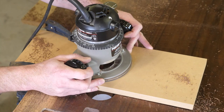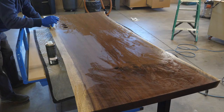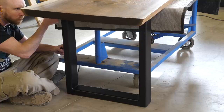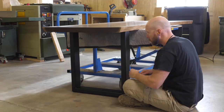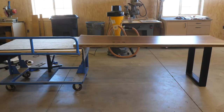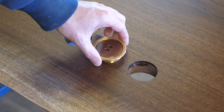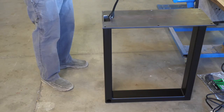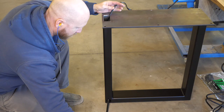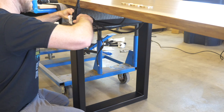Last detail is to bore out some space for the nuts that hold the grommets in place. I decided to add one final coat of finish — this is Rubio's maintenance oil. After buffing off the maintenance oil, it was time for final assembly. I had to come up with a way to hold the table so that I could fish the wires down the leg, then slide the leg under the table. Fishing the wires down the leg was easy enough, but the trick was to zip tie them so that as I pushed them down the leg there wasn't slack hanging down. This took me a couple tries to get right, but once done it gave a clean look.